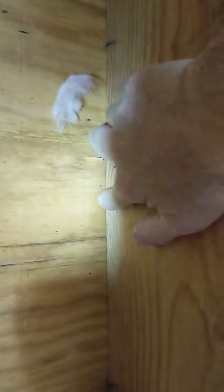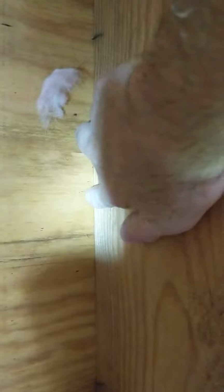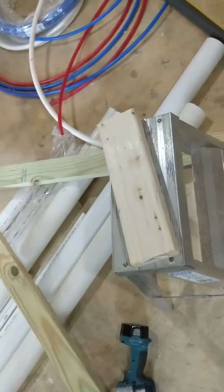down, and if I put my finger right here, I can feel the subfloor move while the joist doesn't. So if I put my finger in the corner and she's stepping on it, I can feel that moving back and forth. That's how I know. I can watch spider webs move, and I can see little dust shoot out. It doesn't take much force, and you'll find it really quickly. Once you find them, here's the solution.